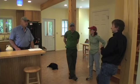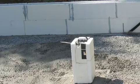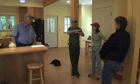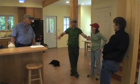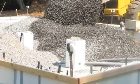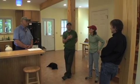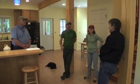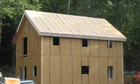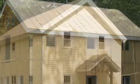You used SIP panels, which are pretty darn plug and play. After the hole was dug, it took us three days of work basically to put in the footing drain and the ICFs, and then put all the sub-slab plumbing and conduits and backfill it to have it ready to pour the slab. If you built it in a traditional stick-built way, it would take a lot longer — a lot more hammering, a lot more technical. The building is a simple rectangle; we avoided any nooks and crannies.